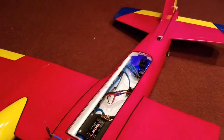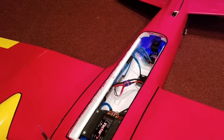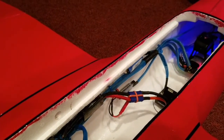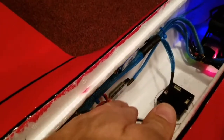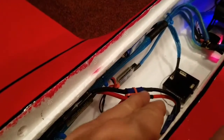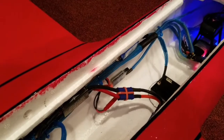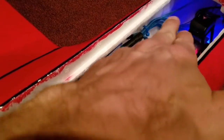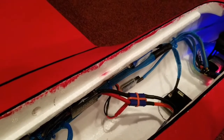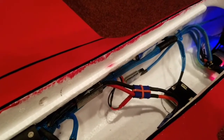Since that voltage range is so great, you obviously can't plug it right into your receiver. So what I used was a Turnigy electronic relay — just look up 'Turnigy electronic relay' and you'll find it. That little electronic device right there acts like an electronic light switch. You plug it into your receiver — you can see the line running right there into one of the channels on my Dragon Link receiver. It can electronically turn the positive on and off via an electronic relay.